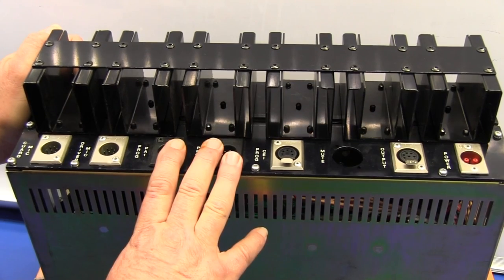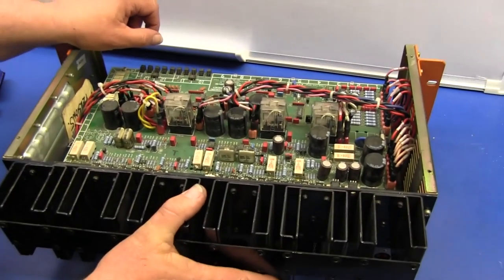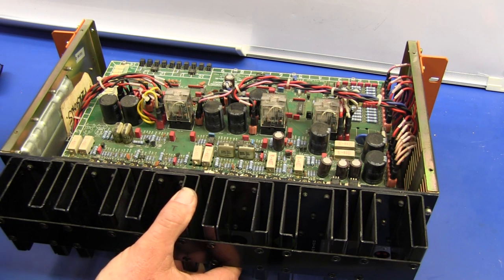Now, also bear in mind, these had to undergo almost military specification testing up to and including, I think it was, 24 hours on a shaker table and 3 weeks swept through the range of vibration on a train, because I know there are standard specifications for vibration for road, air, rail travel and in international vibration equipment standards. You're pressing my memory here, but I think it was of the order of 5 or 10 hertz through to about 500 hertz. Yep, it sounds right. And if you give me long enough, I'll remember what the actual amplitude levels were, because they varied with frequency too.